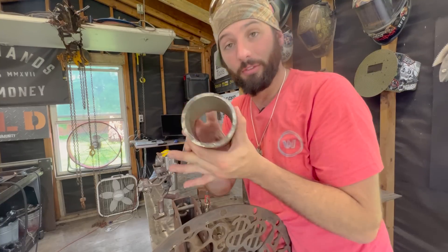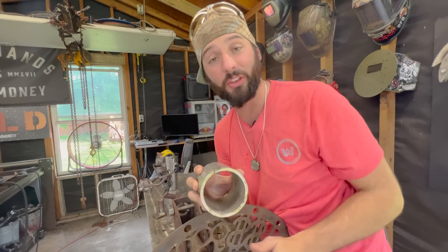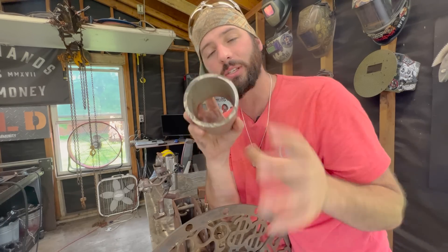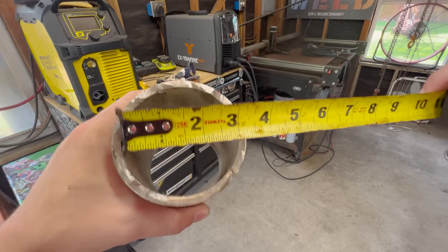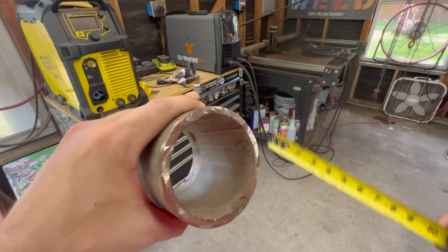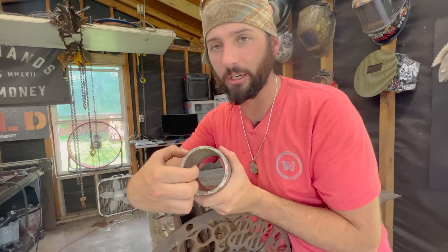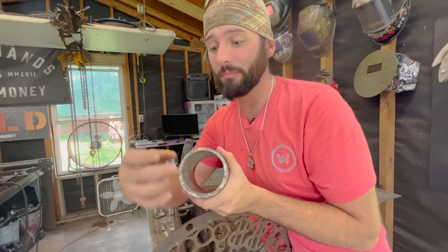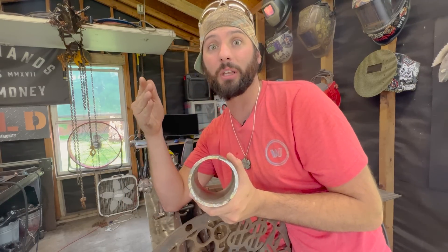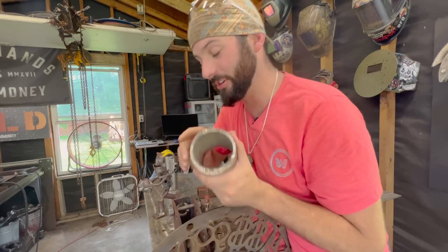As far as standard wall pipe, this is the regular schedule 40. You can go down to schedule 10 or even schedule 5, where you have similar wall thicknesses to tubing. This schedule 40 is about a quarter of an inch — this is some 3-inch schedule 40. It's measured inside to inside, so it's actually 3 inches inside to inside and about 3 and a half to the outside. When that schedule number goes up, the wall thickness goes up and gets thicker; the outside stays the same but the inside wall gets thicker.